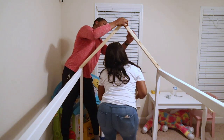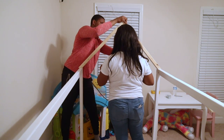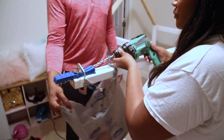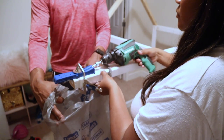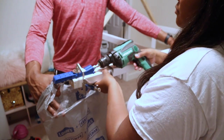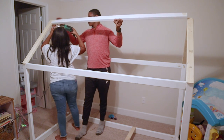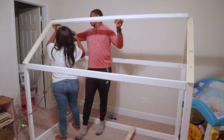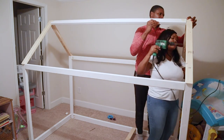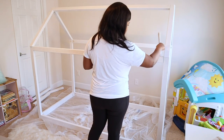To attach the top two pieces together we're adding more pocket holes. You want to make sure your longer piece of wood is on top of the shorter piece. Next we're attaching the third piece cut to 76 and three-fourth inches — the two by three — which is going to be the roof. I'm creating pocket holes on both ends, placing it on top, screwing those holes in, and we'll have a roof.